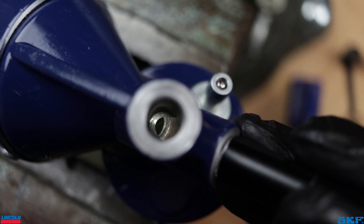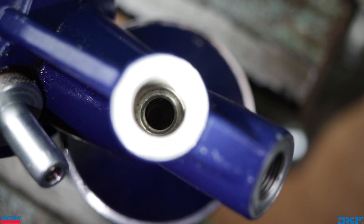After the cleaning, we can now examine the check seat more thoroughly. Nicks and depressions are visible where the ball pressed solid material into the seating surface. These markings may not allow the ball to seat properly, potentially causing pressure and dispensing volume loss, so the check ball must be reseated.